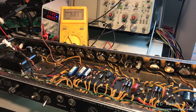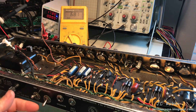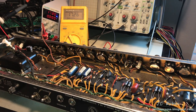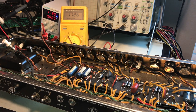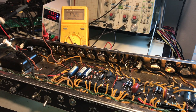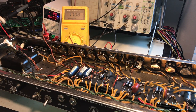We're looking at pin 3 or pin 4 from the tube socket 6L6. And I'll flip the switch. And we can see there it is right now. So that mystery is solved. And obviously the bleed off's gonna be rather slow when I disconnect, having nothing in to drive it. It'll do a slow drop. We can see it dropping now. But I think that's the gremlin right there, finally found.